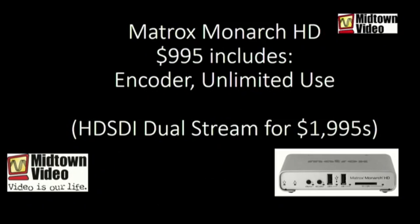But if you wanted to add an SDI channel and the ability to stream to multiple locations at a time — two is a multiple — the Monarch HDX can take SDI in and stream to two different locations. It's got two SDI inputs, so you could use one box to stream two different feeds to two places, or one feed to two places, however you wanted to do it.